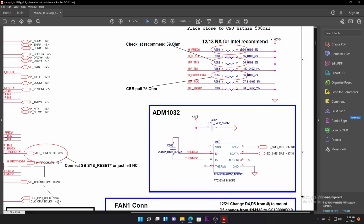You can see the chip number on the schematic, but you can't see the number on top of the chip due to a burn or some other reason. So this is what you do. Since you know the part number on the schematic, not on the chip, it is the component there. It's a U38. So this is what you do. Don't panic. You copy this number here.